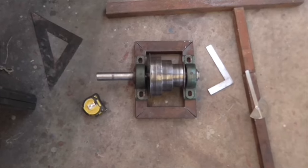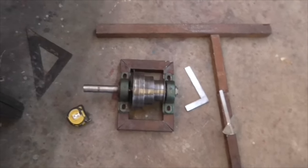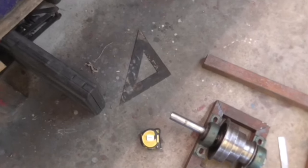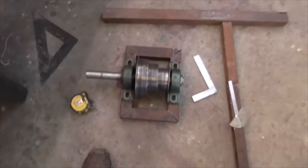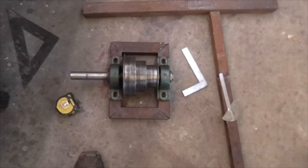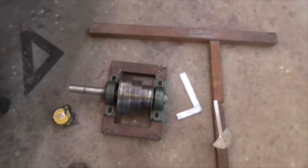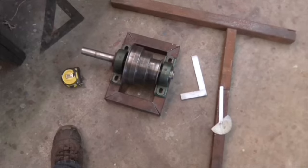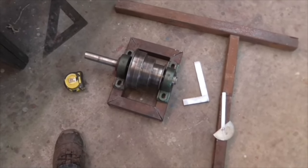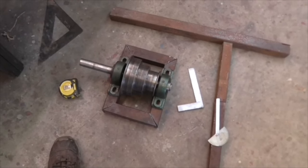And there it is, folks. It needs a bit of fettling at the corners. There's one or two when you're measuring with that set square, whatever it's called thing there, they're not quite 45, but there's very little fettling to do, just a bit of filing off to get them to fit up. I think the thing to do is to just clamp them up and check them, and then just file a little bit off them. But they're a very good fit.